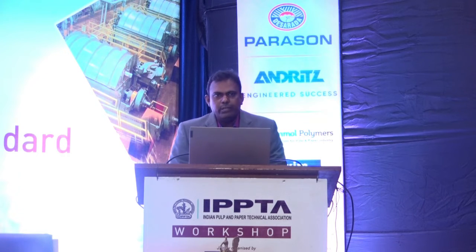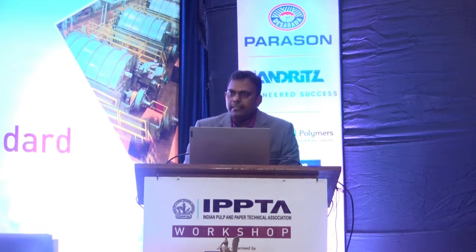So that is most important, that we should have the proper dry and wet cleaning process. Some more things we are also working on, but it is at trial level now. We are trying this: if you remove a higher amount of silica, then the yield increases. So we are working on some different technology, like the desilication process with sodium carbonate, and a leaching process with acid and alkali for removing potassium, chloride, and silica. That also helps us increase the yield and reduce chemical consumption. That is under study now. Once we have success, we can share the results and implement them in our system.